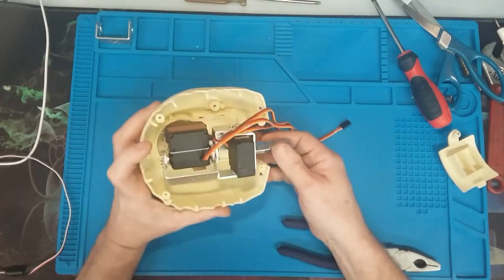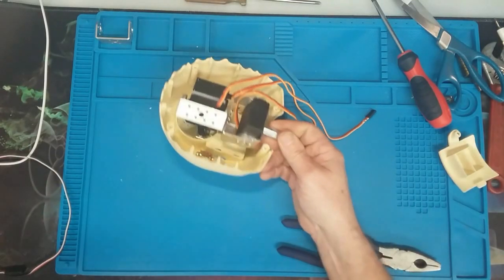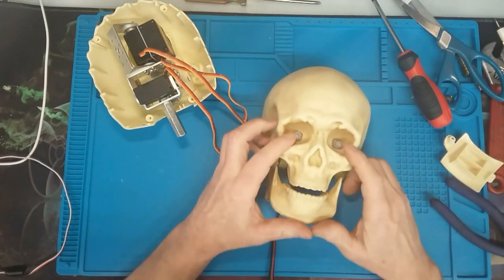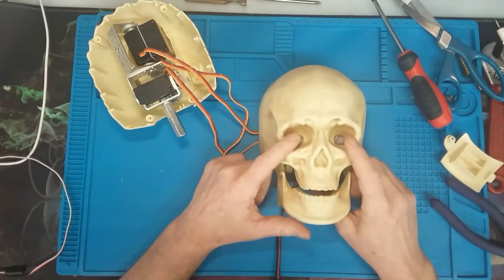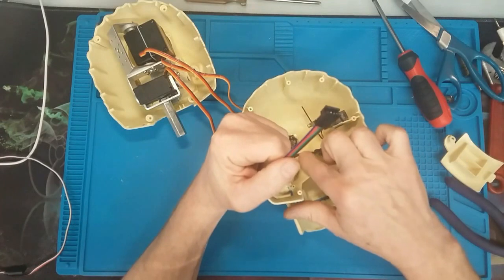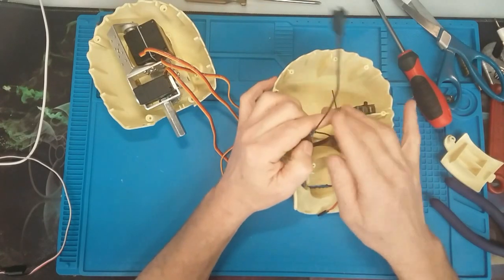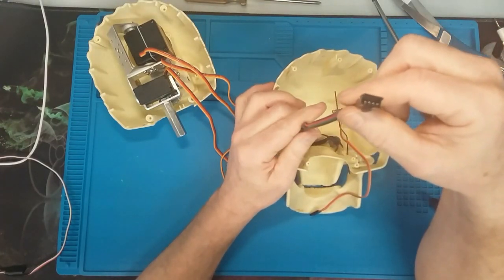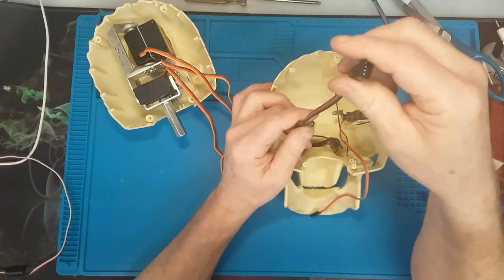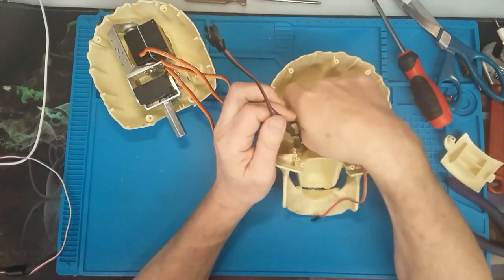That completes this part. For the eyes, I use a couple of LEDs with a four-wire connector and an F-amp. The F-amp pushes the data after the last pixel so it can travel down the wire to the next skull — each skull has about twelve and a half feet of wire — allowing the data to reach the next one.